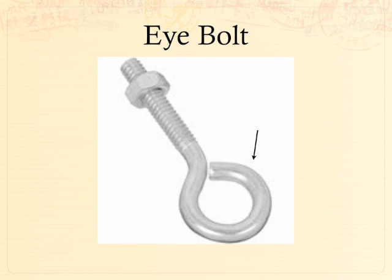If you have an application where failure is not acceptable and you have a lot of weight, they do make forged eye bolts. It's a different type of construction — they take a solid piece of steel, put it in a set of dies, and smash it together, creating a bolt with an eye on the end forged out of one solid piece of metal. In bolt manufacturing, the rod is considered wire because it's a round, long rod of material.